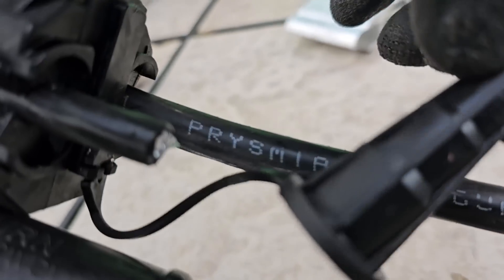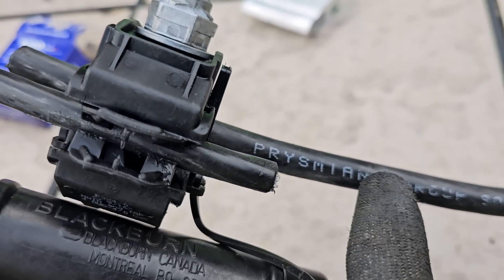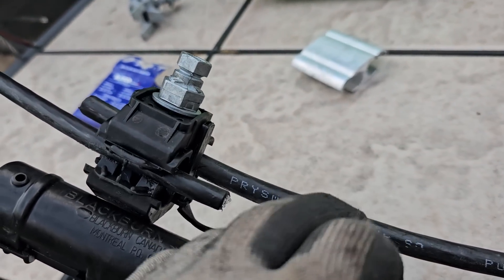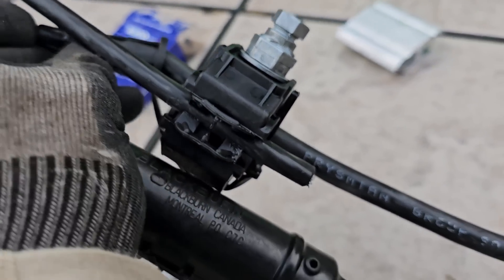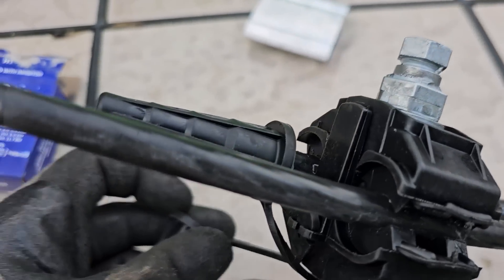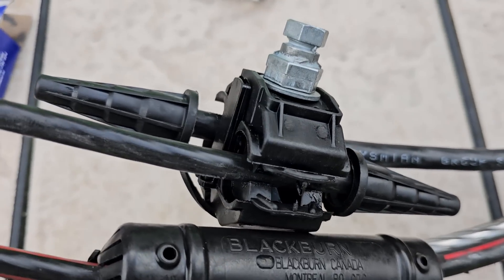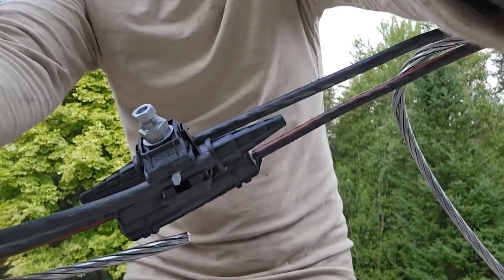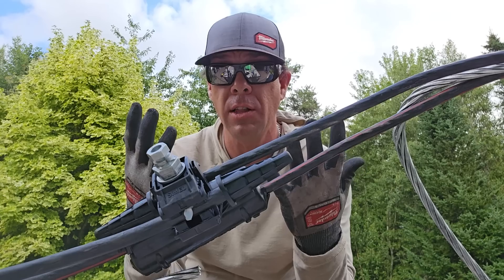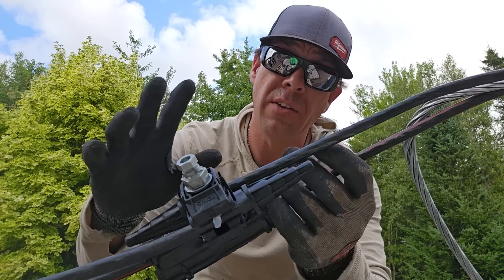These connectors have a cap on each side. A little trick: take the cap on the right and pass it over onto the left side so it has a little tension on the tail — it won't fall off. We'll crisscross it over and tighten it down. You don't have to put those on first, but it helps because now you don't have live exposed ends. As mentioned, we haven't touched any live wire at all — still wearing 1kV gloves, class 0 or class 2.